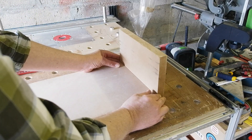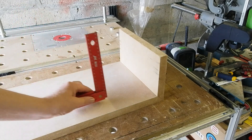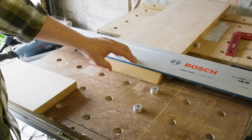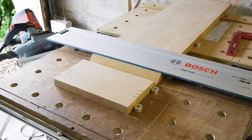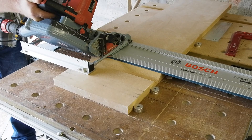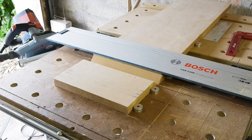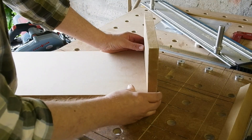The cut was a breeze — one-handed, nice and stable — and gave a lovely clean cut. Both pieces stood together with no fixing; they look a pretty good 90 degrees with no cupping along the cut line, which can often happen if you wobble trying to balance the saw on a 45°. Of course you don't need to have your workpiece overhanging to rest the fence on — you could just use a piece of scrap of the same material and cut the bevel right on the edge of your workpiece. Again, one-handed, no wobble, and the two cut faces stood next to each other — nice and square.